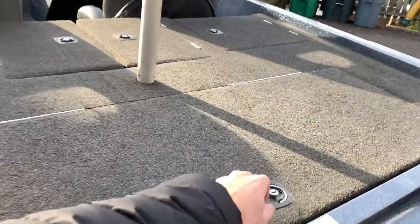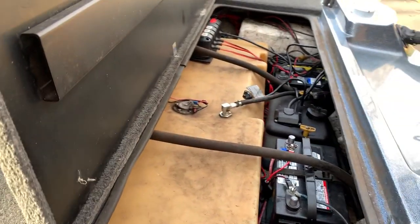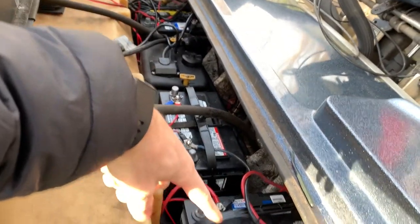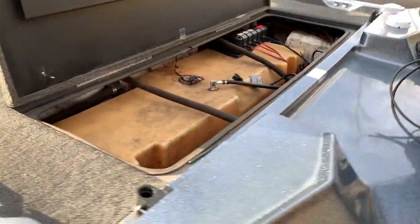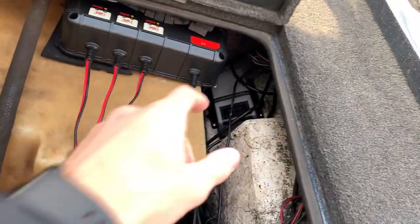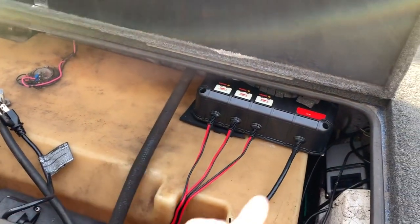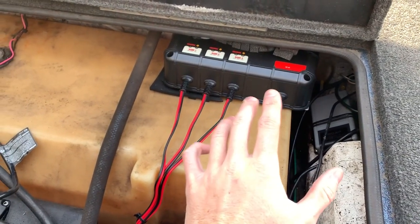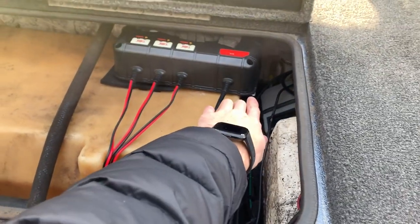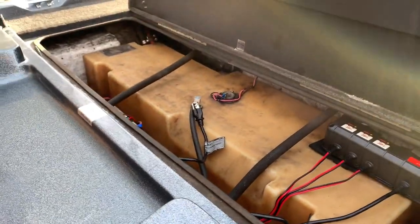Moving on, we can start in this back compartment. It's definitely a mess, but it is what it is. There's a big fuel tank right there that takes up the majority of the space. You've got two batteries for the trolling motor, an oil reservoir, and another battery back there. On the other side, I've got my Pro Air. I just recently installed a three-bank battery charger — my old one took a crap on me. This compartment is so tight I had to make a bracket to secure it and let it rest on the gas tank. That was the best option for me.